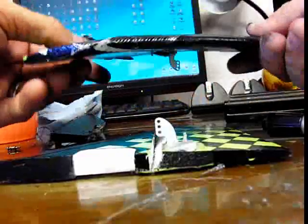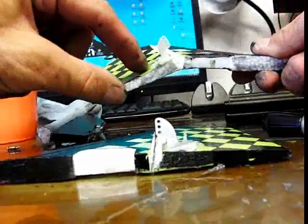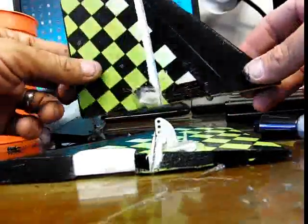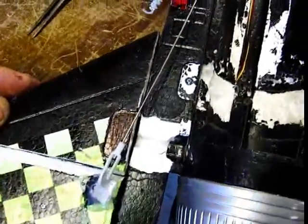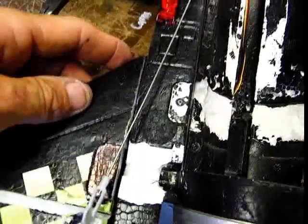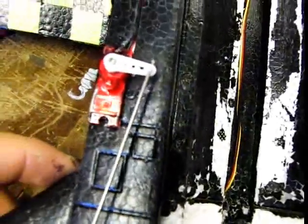Next step is to glue them up. I'll glue them wherever the control horn fits best so I don't have to mess with the linkage rod length — I'll stick it next to the fuselage like that and glue it there. These are reverse servos and their control horns are pointing inward, so I'm going to have them pointing outward. I'll switch them, and if I do it that way on both of them, I can hit the reverse switch on my transmitter and it should work properly.